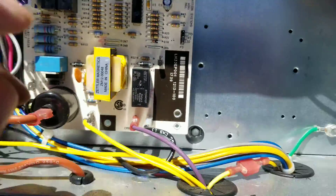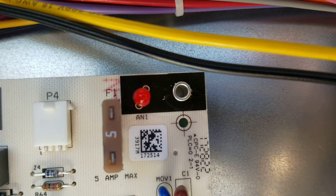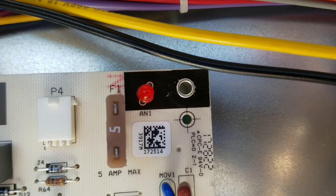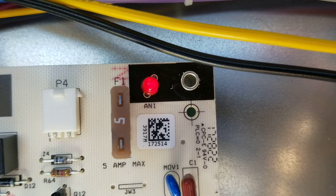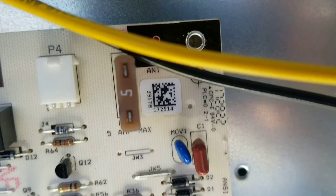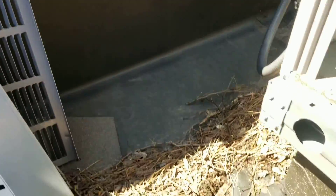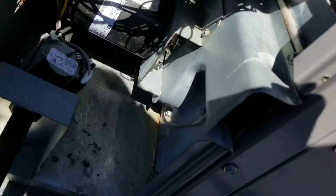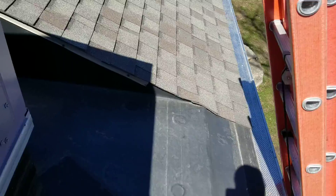We've got a code. Let me guess — it's for overheating lockout or something. One, two, three, four. I got a four-flash limit lockout — limit switch fault. Four flashes, no maintenance, that's what it comes down to. Let me pull the filters.